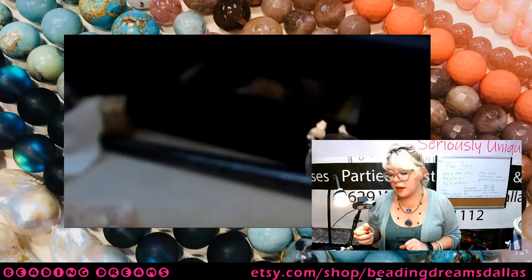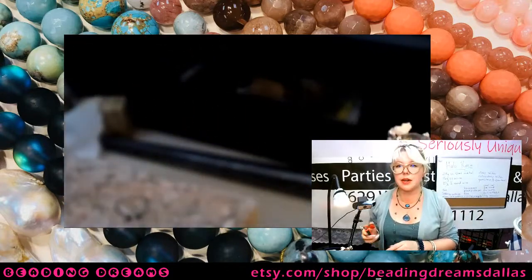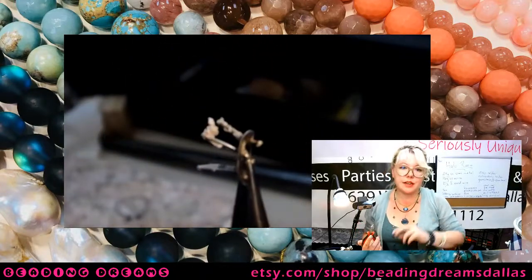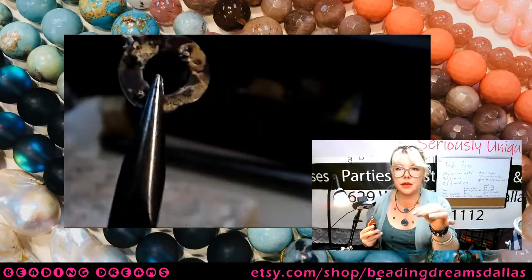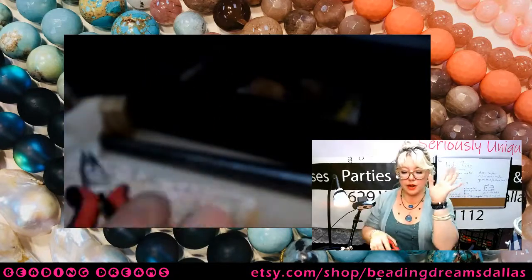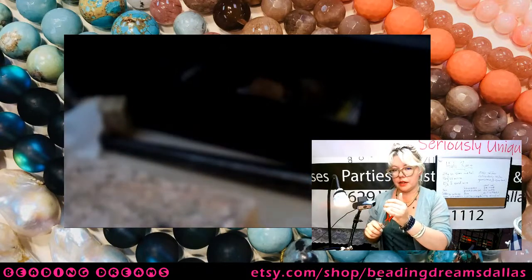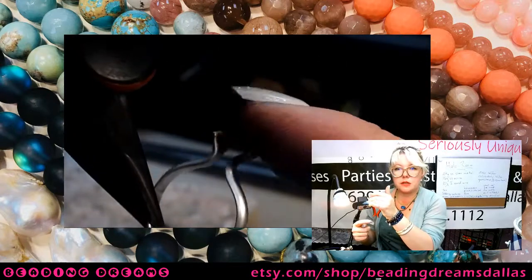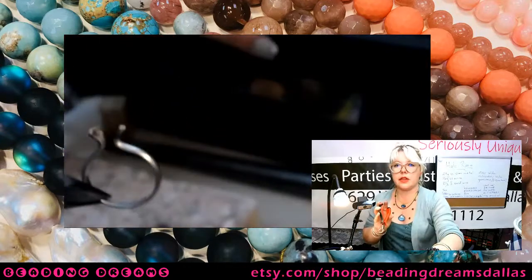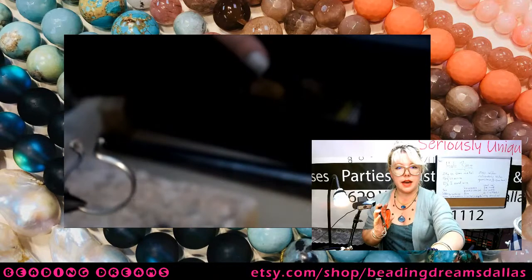This is officially done. So since I failed utterly to create this project in front of you guys, let's talk about a little bit of dissection of what I did wrong. Because I was hurrying and trying to cut corners because I was on stream and trying to finish in a reasonable amount of time. So let's start with number one, why did this not solder on in the first place? It is 100% due to the filing on the top. I didn't file at quite the right angle on this side here.